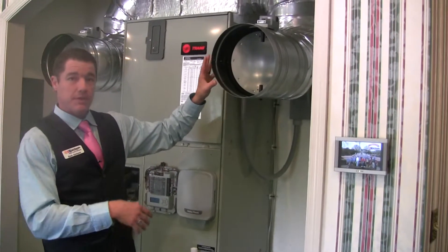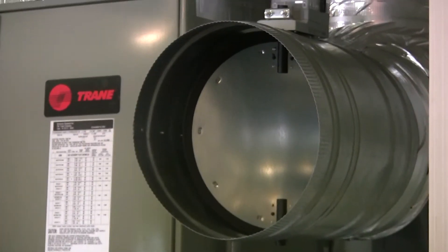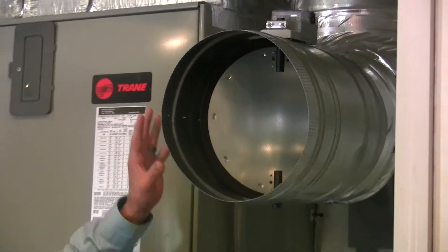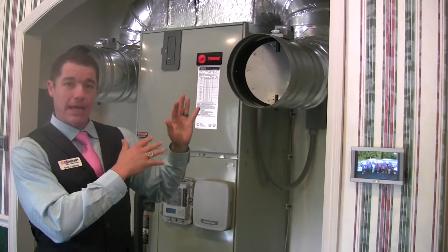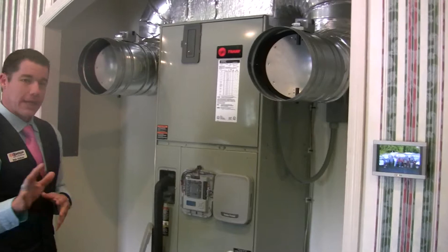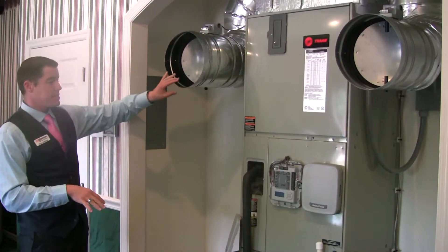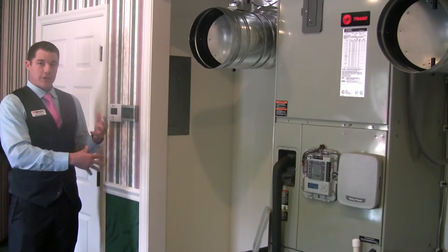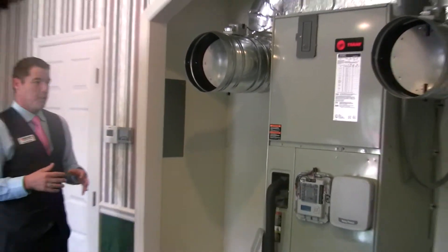This is a damper — this is what would be going to, for instance, your master bedroom, or if you have a bonus room upstairs or a basement. Each one of those zones would have its own trunk line and damper, and as I'm sitting here talking, these dampers behind my head are constantly opening and closing because they're what we call modulating. Before we get into that, I want to talk a little bit more about the communications in the system. You can see here this is a zone we have set up that's being run off of this thermostat — this is kind of our demo unit, whereas the main thermostat is actually controlling and cooling our showroom.